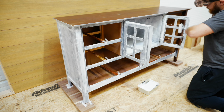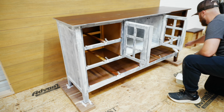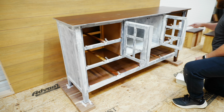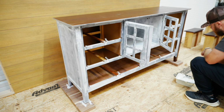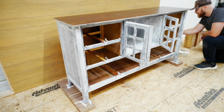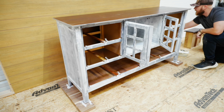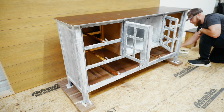It really helps if you will sand in between coats and do 2 coats of this primer. This is going to help block the stains and, of course, cover everything a lot better before the next coat. So do your first coat, let it dry for about 45 minutes to an hour, and then lightly sand with that 400 grit sandpaper and your sanding block just to get rid of any runs or any spots where you may have gotten the paint a little too thick. And that will make it really, really smooth.